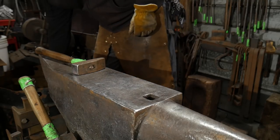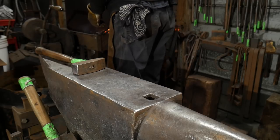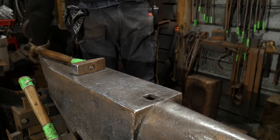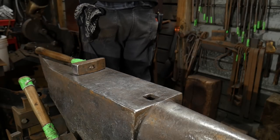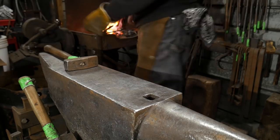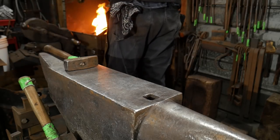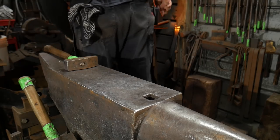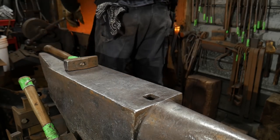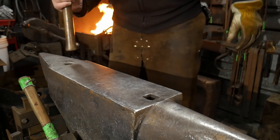So now we're going to cool off this tip, make sure the tip's cooled off, and then stick this thing back in the fire. We are going to carefully bring this whole piece up to a welding heat. When I say carefully — it's because of that little end, it will heat up super quick. So you've got to bring this up in stages and let it absorb the heat naturally into the area that we want welded. I'll bring this up nice and slow and we'll get it welded up.